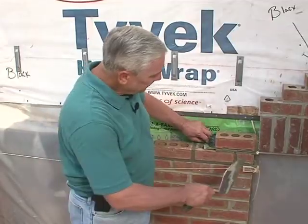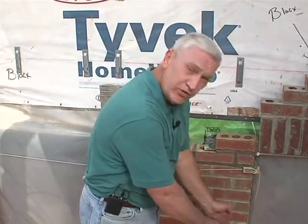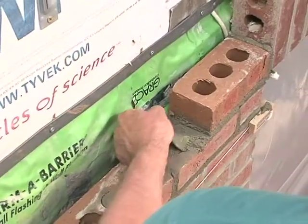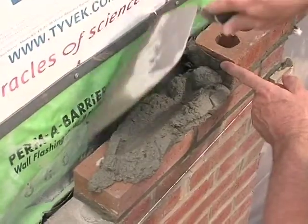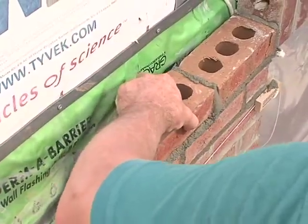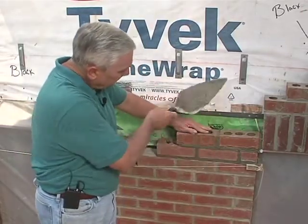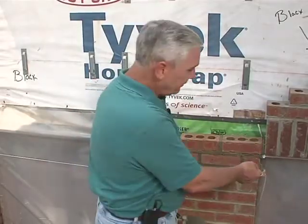Notice how easy it is. The piece of flashing has not been terminated close to the window — where water could get over and run down the jamb — but instead extends about eight inches past the face of the window. To form the dam, it's just a matter of turning up the leading edge into the head joint, spreading the mortar on the next brick with a nice full head joint. Notice how the flashing is in the head joint. What we've done is successfully dam up any water that might get behind this wall — it can't run past this area unless it gets three or four inches deep, which it won't. We've effectively dammed up both sides of the flashing at the window head and are making the rope wicks do their job in getting any moisture out.